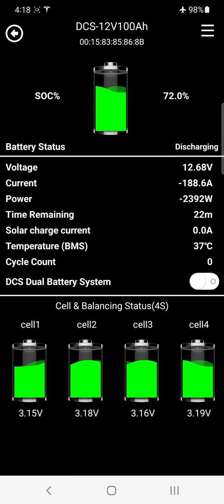With the 2000 watt heater on and chargers off, we're pulling 2.4 kilowatts at 188 amps. Our 100 amp hour marine batteries run a 150 amp continuous BMS and allow up to 200 amps discharge. Even at 2.3 kilowatts and 185 amps, the voltage is still quite high at 12.43 volts, and we've got about 22 minutes of remaining runtime.